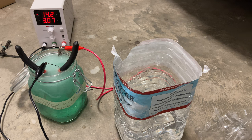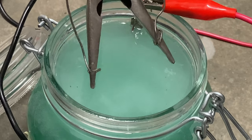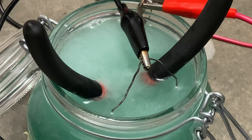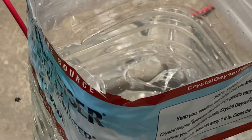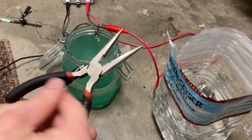To radically speed up the plating, I cranked it up to 3 amps and 14.2 volts — this makes it super fast. I'm gonna pull the pliers out, go over here, dip them in this water bath, and dry them off. Turned out absolutely beautiful. You can see the tool turned out absolutely beautiful — nice nickel coating.